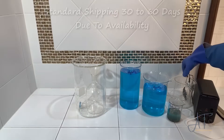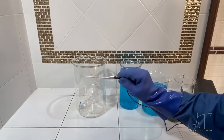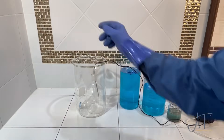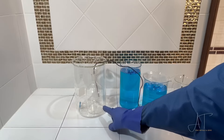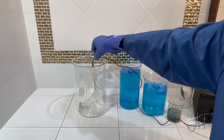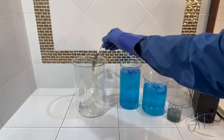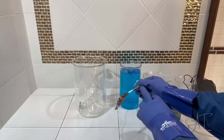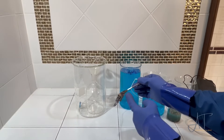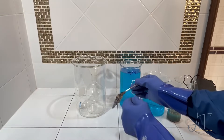For my cathode I'm going to use the same pure silver bar we used in the test, but the cathode will go inside the aspirator bottle, which will generate all of our pure silver and it will stay inside the aspirator bottle that has a Dacron filter on the outlet port. We'll fill both of these up with the electrolyte. For the connection I used pure silver and Teflon tape, wrapped where it will dissolve, and I'll just continue repeating this process by attaching it by wrapping some silver around the post and securing it with Teflon tape.